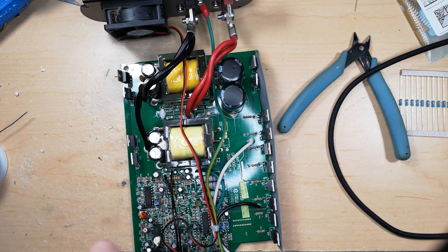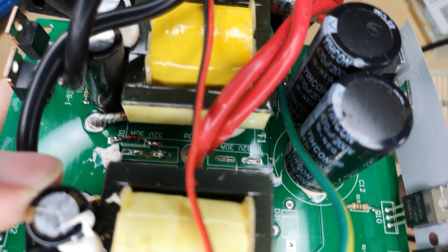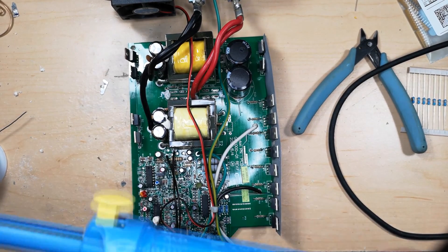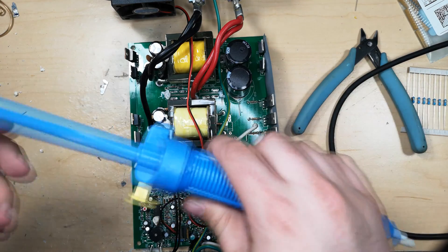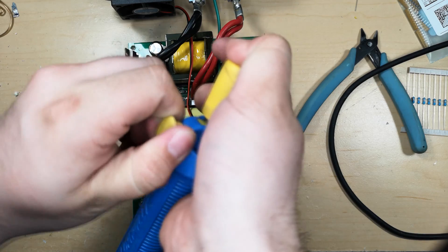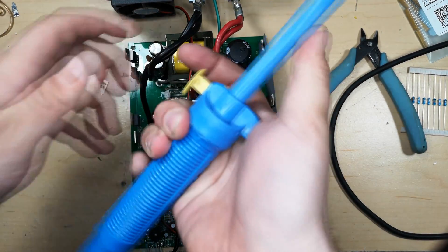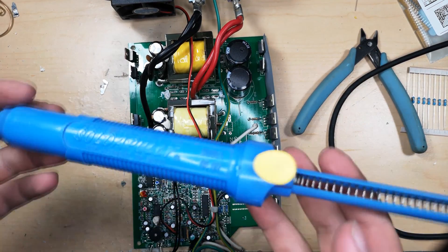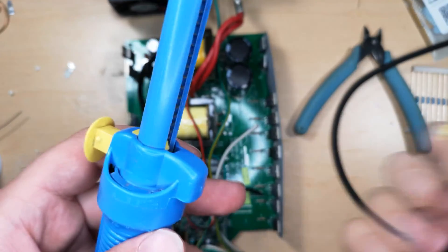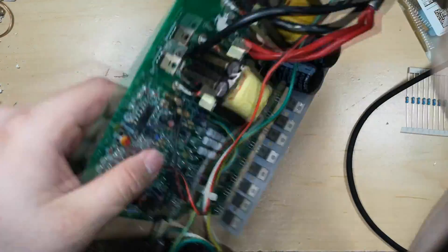I had a look at the video and I think the diode might have actually already been broken. I basically just salvaged a random Zener diode because I have no clue what the actual voltage spec is supposed to be, so we'll just see if that works. Unfortunately my solder sucker broke - I push it in and it no longer pops out. I have to manually pull it out, which sucks because these aren't super cheap. It's lasted a long time but still. The little piece of plastic that broke came out, so maybe I can stick that back on. Anyway, I'll keep going clearing out those holes.